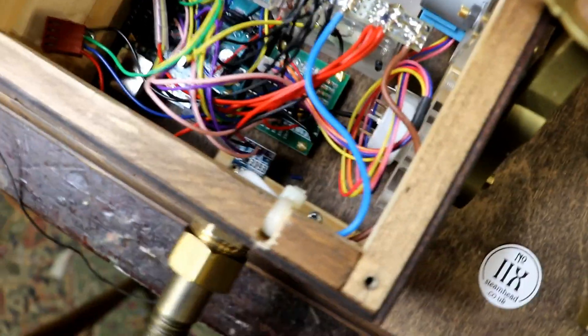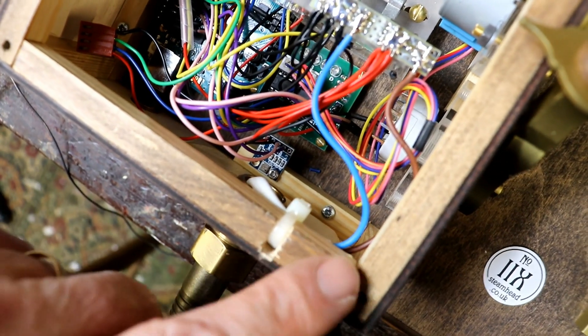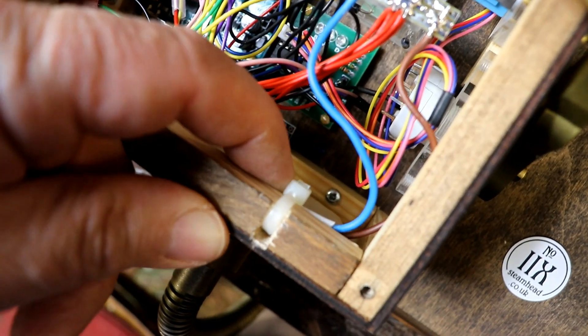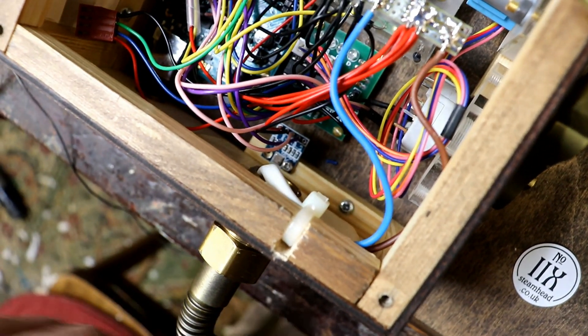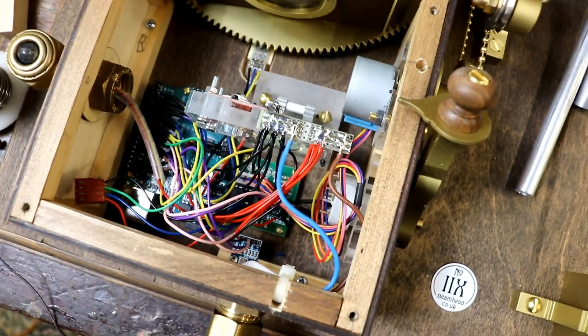What I've decided to do is drill a hole through up here — this is all very strongly glued — and put a cable tie around it so it grips the corner. Whatever you move, there's enough free movement but it's not going to move the connecting wires or the solder joints.